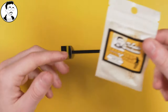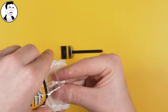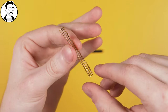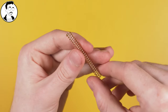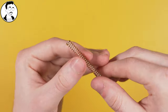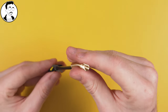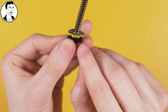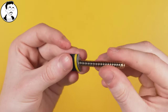Next, grab our recoil spring — this is our Snappy Boy recoil spring for AAP-01. This recoil spring is special because unlike any other on the market, it is coated with a lovely gold finish. This is a secret finish we use at Waldo Customs on all our springs, allowing for a much slicker and less friction-induced effect when shooting. The metal plate is there to stop your recoil spring damaging the rubber buffers — this doesn't happen with ours purely because of this metal plate.